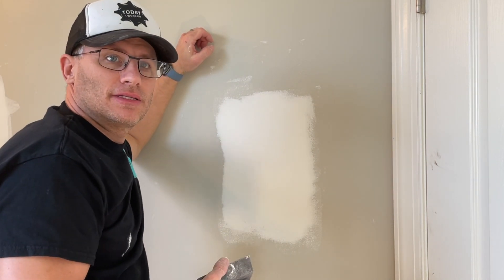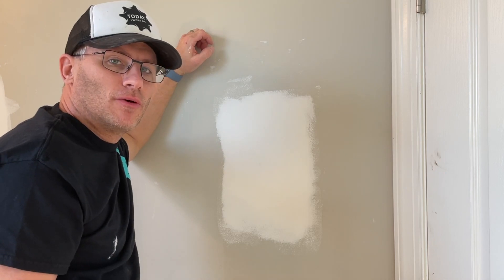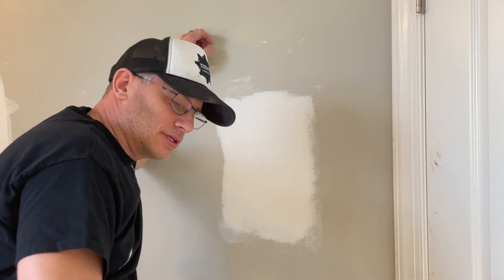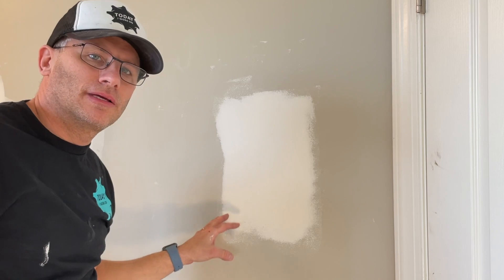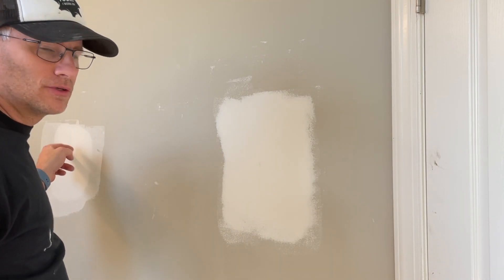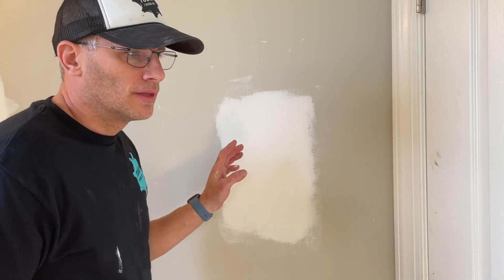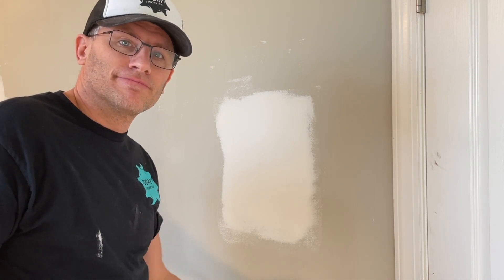That's how you patch in a piece of blocking for a towel bar. I think it's the quickest, easiest, least painful way of putting in some blocking. You don't need a whole 2x4 for a towel holder. If it was a grab bar where a human being is actually using it, yes, I would open up the whole wall — but for something like this, this is a perfect way to put the blocking in. To recap: find a stud — 2x4 or 2x6 — on one side of the towel bar, then put in the blocking so you don't have to put in two pieces. That's a wrap. Thanks for watching — if you like this video, please like it, and if you like these home improvement videos, please subscribe.